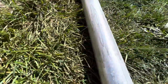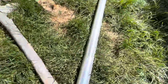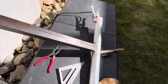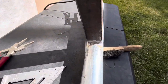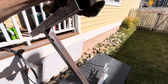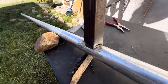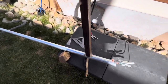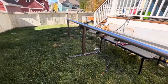We prep the rail to get ready to attach in the three spots — a foot in from the end and one right in the middle. The rail's only 12 feet long. Now I have it tacked on. The first one doesn't matter because you can just match the other ones to it. You do want to get your prepped areas kind of in the same spot around the rail. Now I just need to finish welding them all down, but that's pretty much it.